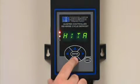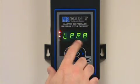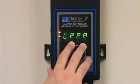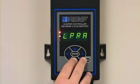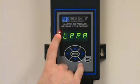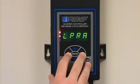Pressing the up and down arrow buttons, I can scroll to the other alarms that are also in existence, which is a low pressure alarm. This means the pressure is below a certain preset set point and has been for a certain amount of time. In this case, the set point has been set to five pounds and my current pressure transducer is exposed to atmosphere, so it's reading zero PSI. That alarm is also going to be a shutdown alarm, which will be indicated by the red LED displayed on the controller.